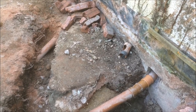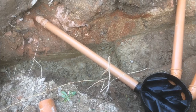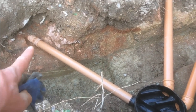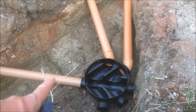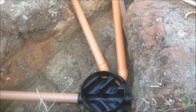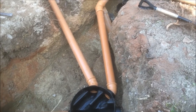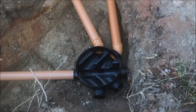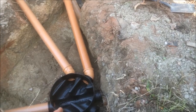Just finished it - there's where the old manhole was, and you've got your inspection chamber here. The main flow goes through that lowest part and then you feed in your other pipes through the sides. I suppose if you could, it would be advantageous to use a straight-through flow, so if you're bringing a pipe from over this way that would work well.